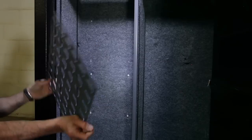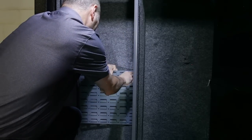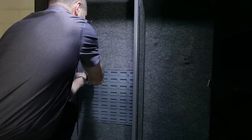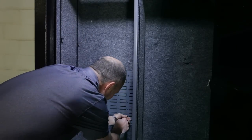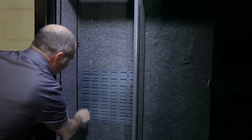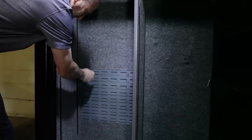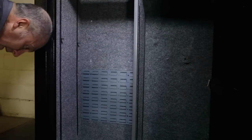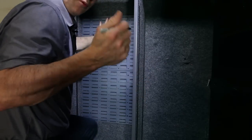I've got my anchors in place. I'm going to take my panel and put the screw in the first hole. When I install these, I do it with hand tools. You can use a drill, but you run the risk with a lot of torque of stripping some of this out — it's not that hard to do by hand. I'm just using four anchors. The shear load on this system with four anchors, we rate it at 400 pounds, so you've got quite a bit of load capacity. Now I'll take the second panel and repeat the process with the Sharpie marker.